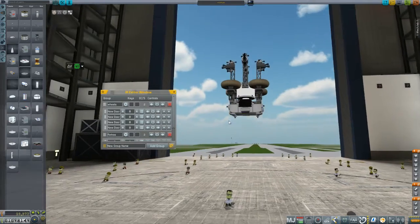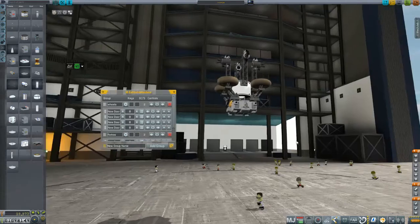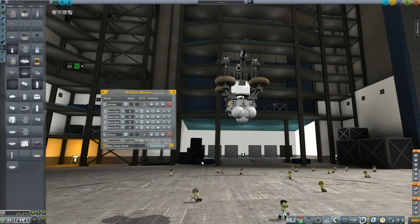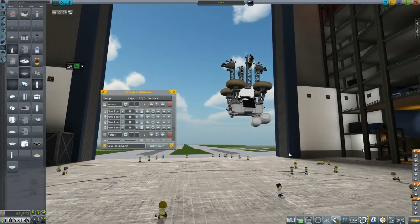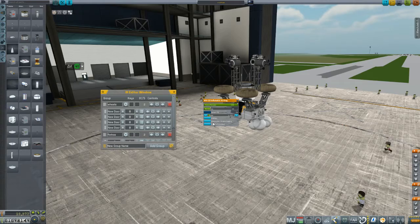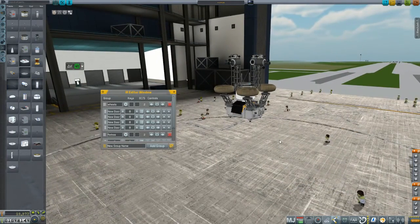The landing system - you'll notice there are no landing legs on this because of the retro pack being on top. I've gone instead with airbags. There are four of them placed throughout the rover in positions where, if the rover should tip over, I can deflate and inflate airbags accordingly to try to get it back right side up and help get the wheels underneath it - which them articulating also does kind of help with that leveling process in making sure we can set this guy down wheels first.